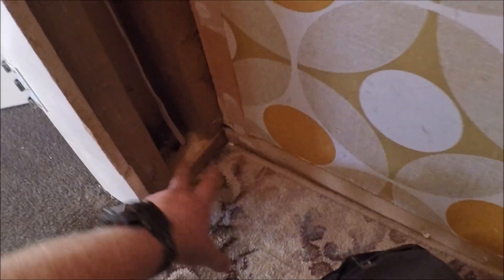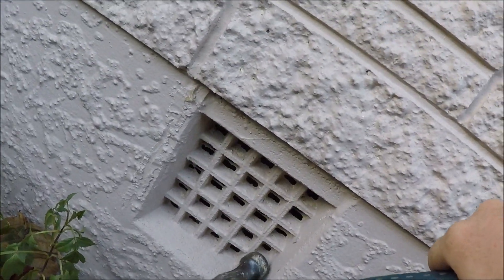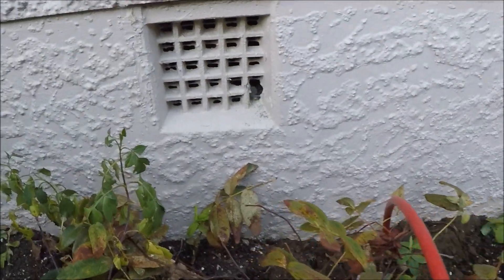I've already got a reference for where I need to drill up under the house. I've gone along about 100mm and you'll see the bottom plate of this wall. I'm going to put the tape measure right where the cable comes up and measure across to where my hole is. The stud is right on about 1500. I've cut it out a bit — I'll be putting a bit of conduit through there.